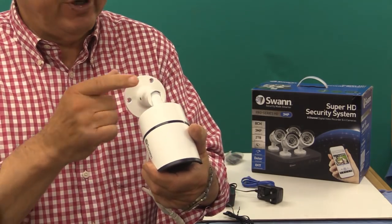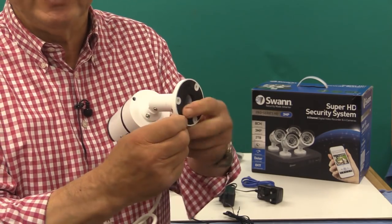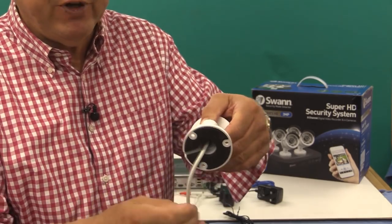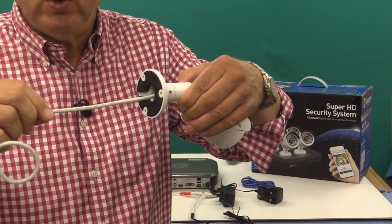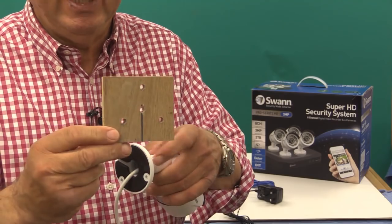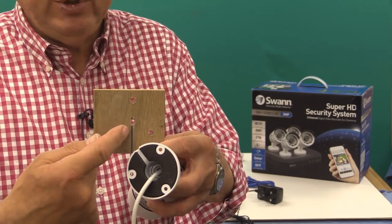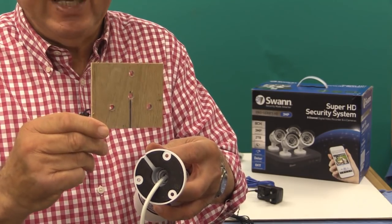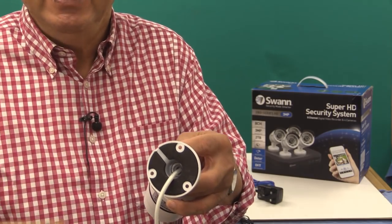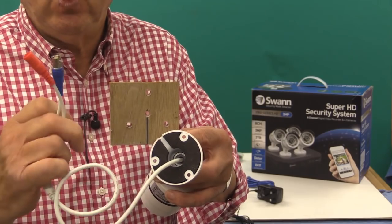When fixing the cameras, there are three screw holes. At the back there's a route out which the cable can follow if you wish to run it in the outside world, though there's a vulnerability in that someone could cut the cable. I prefer having the cable go directly into the wall from behind the camera — it's neater and safer. To make this easier, I've made a little template with three holes matching the camera's screw positions and a hole dead centre. I'd place this on the wall, use a 6mm masonry drill bit to mark the positions, then complete the drilling. For the centre hole, a 16mm hole allows all the cable ends to pass through.